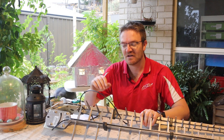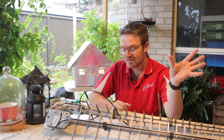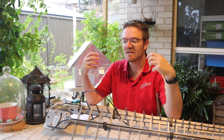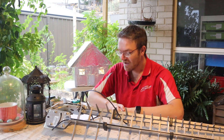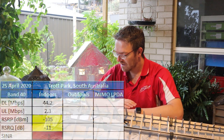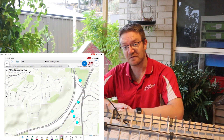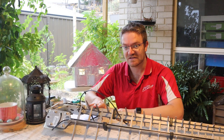For our specific test, I first tested inside the house as a baseline. I try to keep the modem up and running because when you do a reset with antennas connected you start with a whole new setup — the modem and network see you as a different device, so it's a completely new connection every time you reset. My first test was in the house itself. I got connected to Band 40, RSRP was minus 105, RSRQ was minus 11. On the ACMA website I could see the specific site I was connected to for that frequency band.